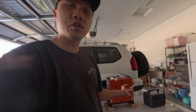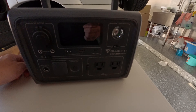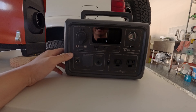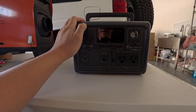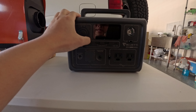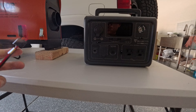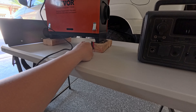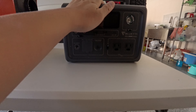I used it once on my last trip and it was very successful, except I didn't have enough power. These things do require a power source, so make sure you get a pretty decent-sized one. I'm using my portable battery bank — it has 268 watt hours, 600 watts — and this only lasted me about five to six hours on the low setting. You definitely want a bigger battery. I should have listened to Modded by Phil — he suggested getting a 100 amp hour battery. You can get a decent one, or one of those Chinese-made batteries on eBay for around 200 bucks. All you need is a bigger Anderson plug, hook it up, and you could probably use it all night long.